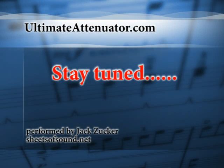For some bonus material, I'm going to let you hear what the attenuated signal sounds like compared to the non-attenuated signal. First, I'll demonstrate the non-attenuated signal with the attenuator in bypass mode. Then I'll demonstrate the talking level — in other words, the attenuator turned all the way down to about 7 o'clock. In Sonar recording software, I'm going to normalize that volume so the two volumes are relatively equivalent. Note that because of the signal-to-noise ratio, there will be some hiss in the attenuated signal. First, the non-attenuated signal. Next, the attenuated signal down to talking level.